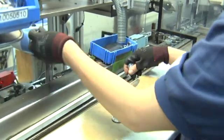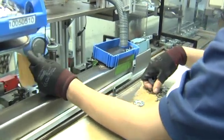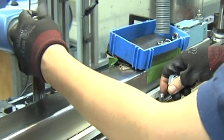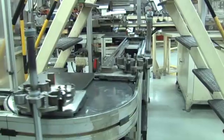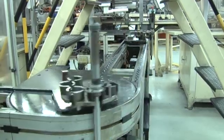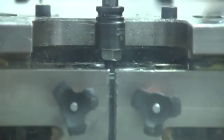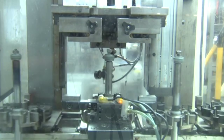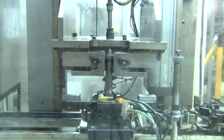When the bar comes back on the piston, the nut is placed on the bar and is fixed with a special extra strength adhesive to ensure the assembly and make sure it doesn't come loose. The correct torque is then provided and later its value is confirmed together with the angle of the nut, to ensure that it is not tightened at an incline, which could lead to the piston coming loose despite providing the correct torque.